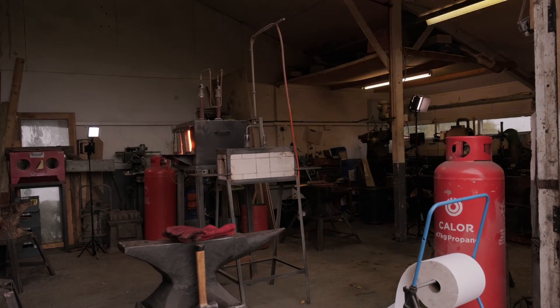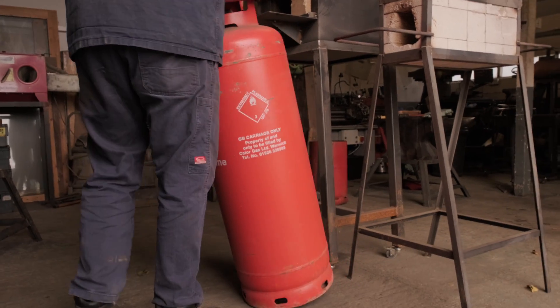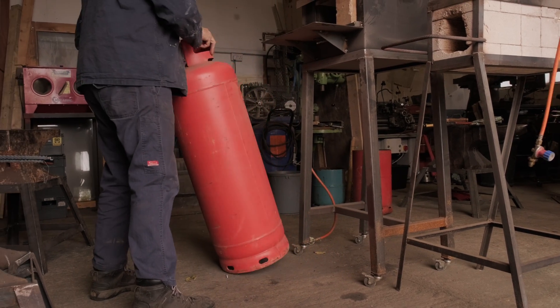Your billets are going to take a long time to get hot relative to running air-rich, where the furnace is roaring away and getting very hot quickly. With the same amount of gas but with the air shut down, you are not going to generate as much heat. On my particular forge, when setting up for the initial set-down before the full forge weld, I double my gas pressure going into the forge — so double the gas, but I still have to shut the air down to nothing, and it can take quite a long time for that stack to get hot.